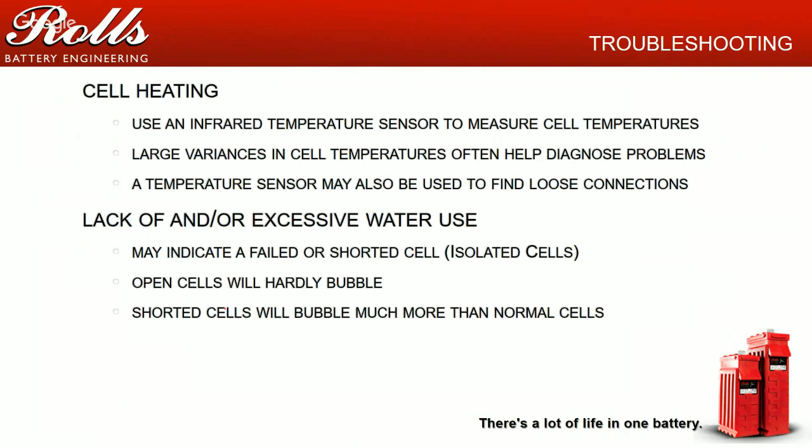When a battery gasses, two gases are leaving the battery, and that's hydrogen and oxygen. Oxygen, really not a big deal, especially in those kinds of concentrations, but unfortunately, hydrogen is very explosive, and especially in a tight, confined area, you want to make sure that you've got active ventilation or enough ventilation that turns on soon enough to remove the hydrogen. Generally, while you're charging, the bubbling should be relatively uniform. Again, every battery has its own internal resistance, so the amount the battery bubbles is going to vary depending on what that internal resistance is.